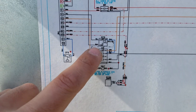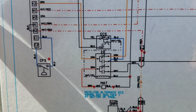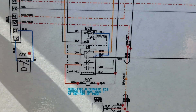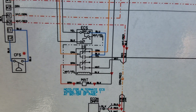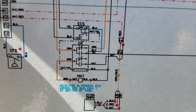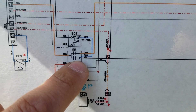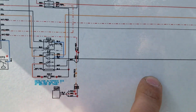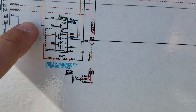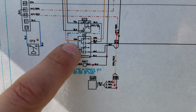As the Y1 call comes in — yellow on top — you have a high and a low selection. High is the blue wire, low is the white-yellow wire. You can see the white-yellow goes down to the economizer relay coil to enable the economizer relay. So when it's 55 degrees or lower outside you get the low selection and the economizer relay is enabled. When it's warmer outside you have the high selection — it goes on that blue wire, ties in with the yellow, and goes out to the compressors through the limit switches.